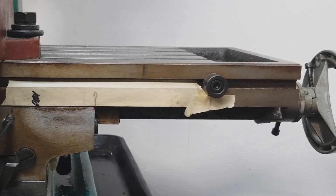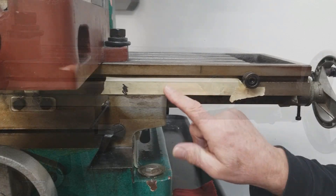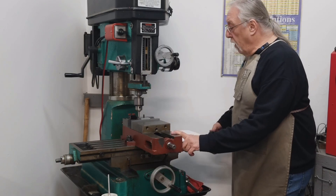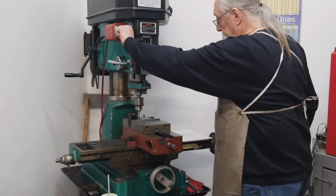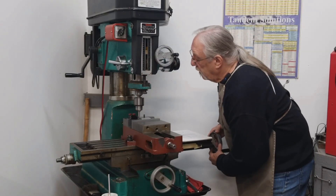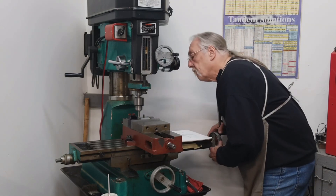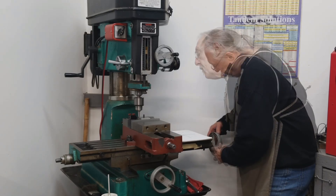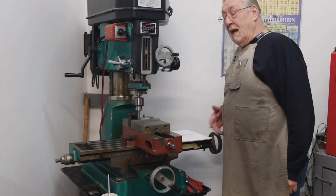It's really hard to be off, because your zero is set on your dial — if you're one hundred thousandths off, you can see that. You're not looking for super accuracy, because you have your dial. For the rich guys that have a DRO, hit that zero. Okay, we're going to move off and we're going to come up on that really slow.